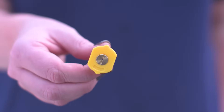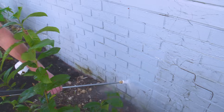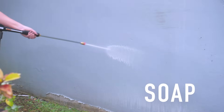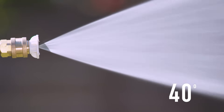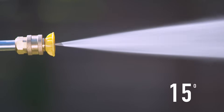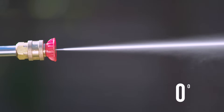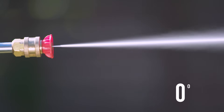Test the tips on a section of your exterior to see what works best. Choosing the right tip is extremely important — using too much pressure can damage the surface. Pink is the low-pressure soap detergent nozzle, used when applying detergents. White is the 40-degree nozzle — a wider fan of water, less pressure, best for softer surfaces. Yellow is the 15-degree tip, typically used for surface prep such as removing dirt, mildew, or paint, and can be used on most surfaces. Red is the zero-degree tip — be careful with this one, as it delivers a very concentrated stream and highest PSI and could damage softer surfaces.